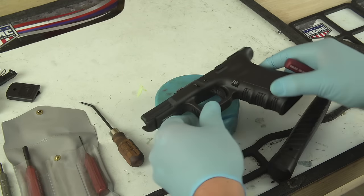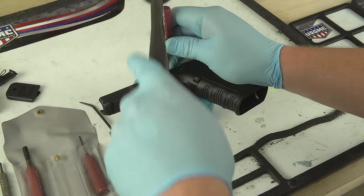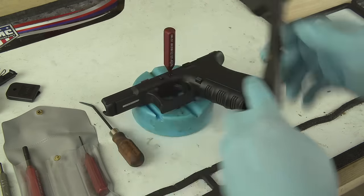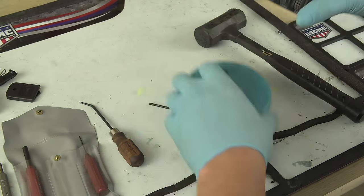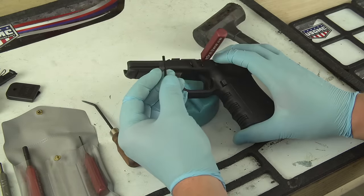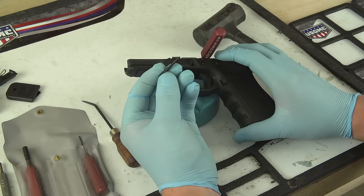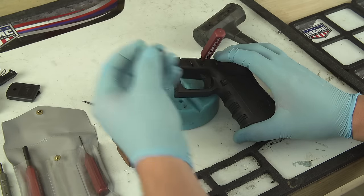So with that being the tightest pin in the gun, go ahead and drive it out first, which shouldn't be bear tight, guys. All right, so I am using just an armorer's block here from Brownells. You can see it's a slotted pin with two heavy ends, and that's just to allow for a good tight fit so nothing moves around in there.